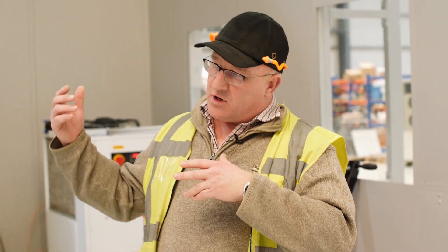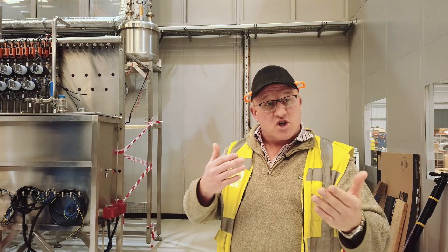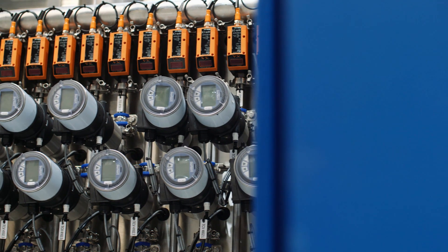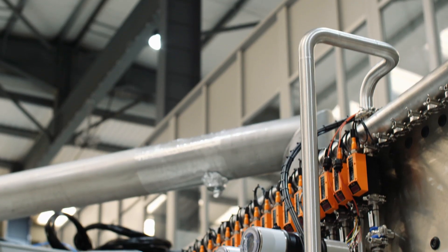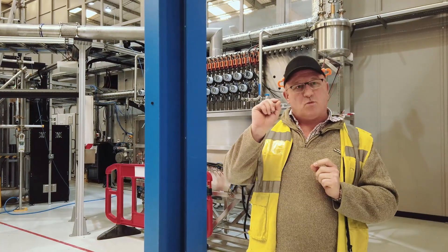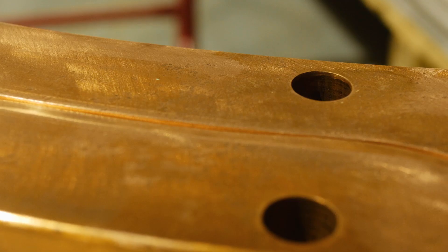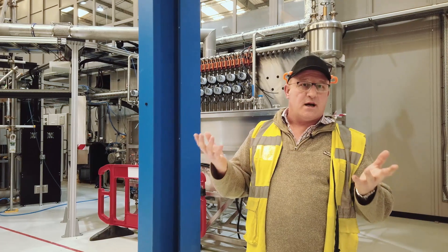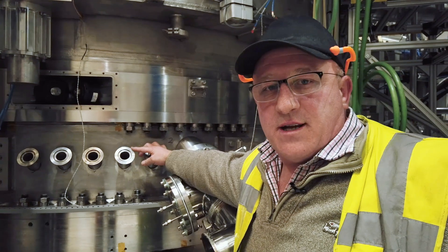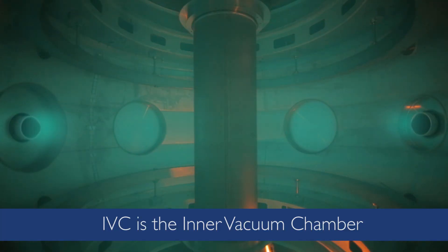We don't actually control the flow of nitrogen by using any mechanical means. We actually control the flow of liquid nitrogen into ST40 by controlling the back pressure — the actual gas that comes off. What we do is we split the nitrogen up into 40 channels, then break out into about 160 channels. They're very small pipes that run inside the copper coils. We run the nitrogen through the center of the copper wire, which then allows us to cool only the parts we need. This is where the liquid nitrogen actually comes into ST40 to cool the main components on the IVC and the coils.